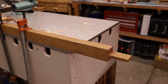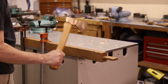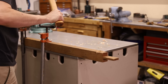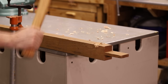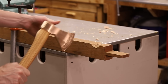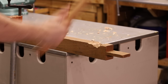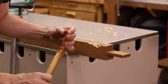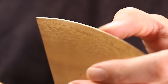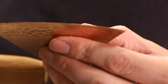Here's a piece of really dry white oak. I'm not going to go crazy hitting this oak because I really don't want to destroy the hatchets if I don't have to. If I see that they're cutting really well then I'll keep going, and if not then we'll know we've reached the limit of these hatchets. Let's see how well they do. I'm absolutely amazed with this result — I really didn't expect the tin bronze to be so tough. There's almost no noticeable dullness at all. Let's try the aluminum bronze next.